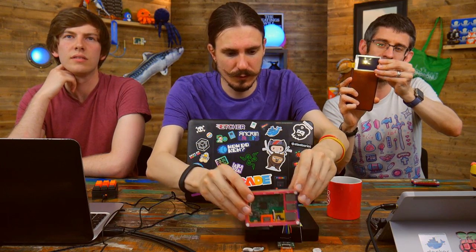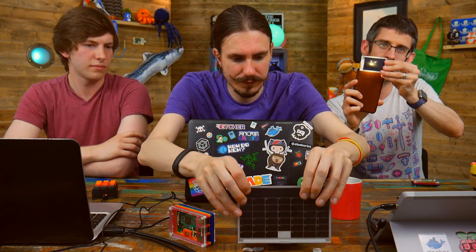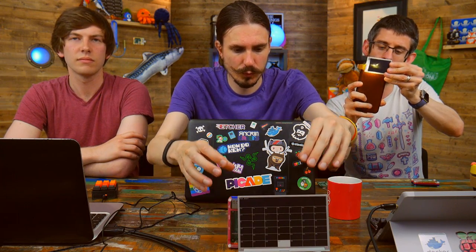Yeah, it could do a magic mirror as well. I don't know if you need light running through the magic mirror for it to be visible, but it's worth a go. You could probably front light it. So if you had it inside the mirror, you could have edge lighting illuminate it. That would work. We've got that mirror panel up there. Yeah, we should definitely give it a go. They are actually slightly transparent, these displays. So you can see light does shine through, but it has a funny colour cast, so I think backlighting is probably not feasible. I think the reason it looks a bit odd is because the back of the display is mirrored, so I think front lighting or edge lighting is probably the way to go.